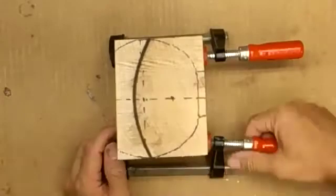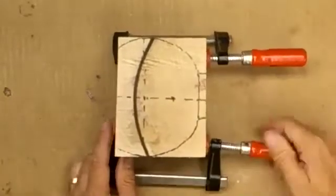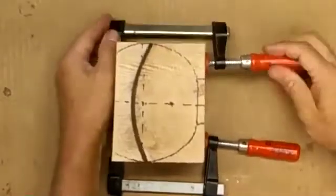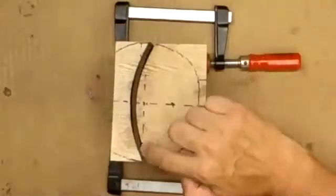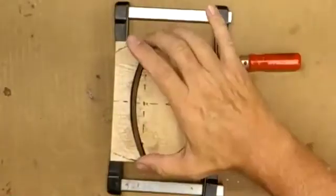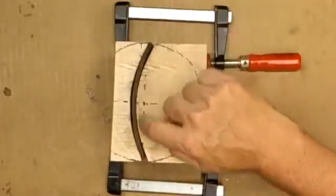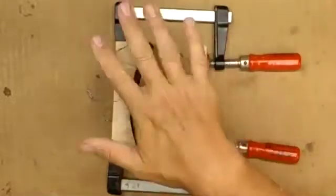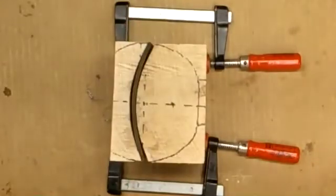So after that 3 or 4 hour period, I'm going to loosen the clamps up and just set them down, but not take it apart completely. So I'm still keeping the form to a degree, but now I have airflow in here. And now the air can get out, the moisture can get out, and this can dry. And that's going to take a couple more hours.